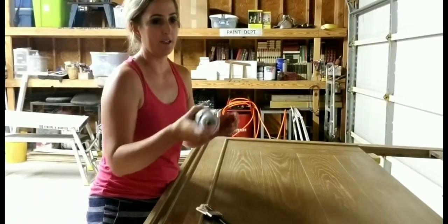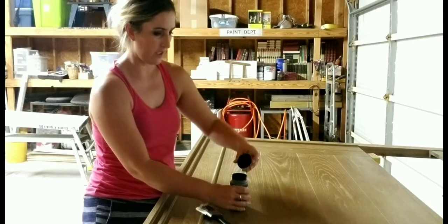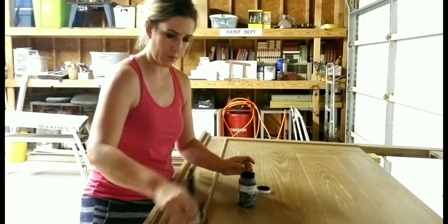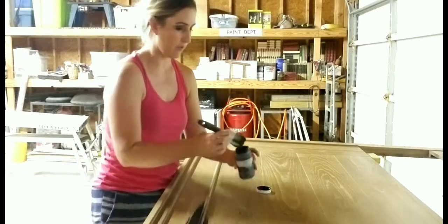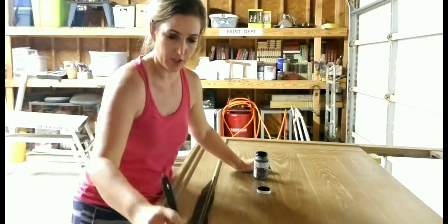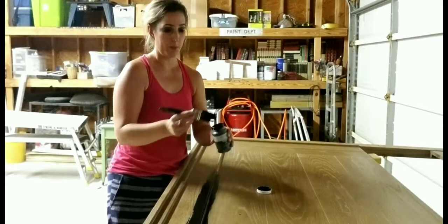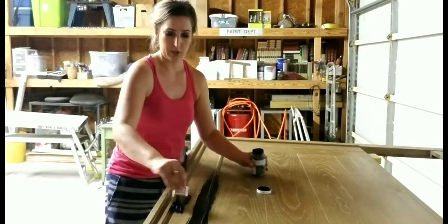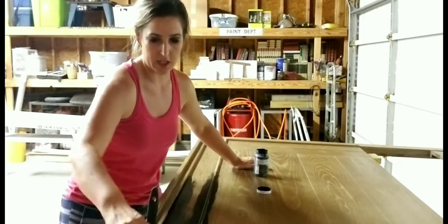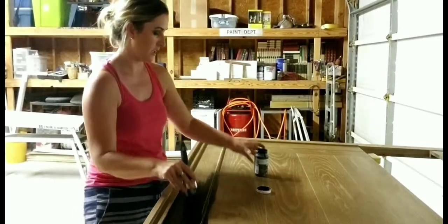I'm going to shake it up a little bit. I added some water just in the can — that should be enough to put a coat of paint on it. I'm going to see if I need another coat once the first coat is on. Now this chalk paint really goes a long way. I like the Waverly chalk paint from Walmart — it comes in a bunch of different colors and I can finish a lot of projects with it. Now, if you want to do black, do not use chalkboard paint. That black is a little more shiny. If you're wanting to do black chalk paint, get the ink color.